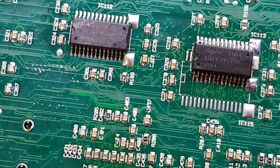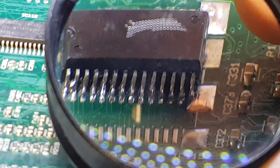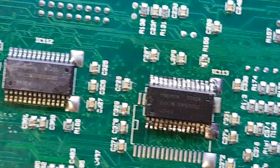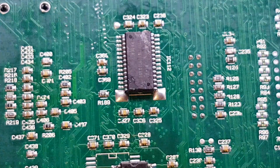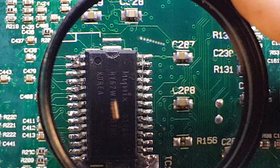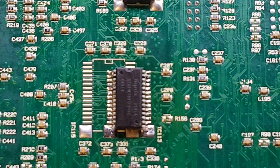I'll use this lens out of a projector that I salvaged and we can have a look and see how it looks. That doesn't look too bad. We can see we've got a short there on the end, but the rest on that side looks good. And then if we tip the board up and get it in focus — I think there may be a short on that end as well. Just spin the board round for a closer inspection. No, that one does appear to be fine. Those are nice enough joints — we'll just clean that short out.